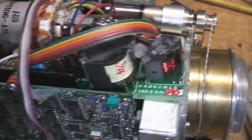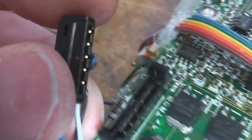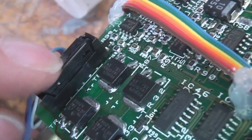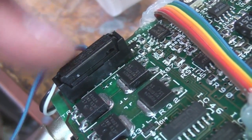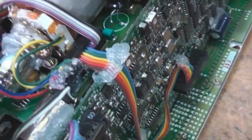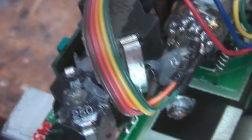Just to get the EHT voltage - I think these probably use maybe 2-3 thousand volts on the final anode on a little tube like this. And there's the circuitry at the bottom. This stuff is pretty much bog standard - this is the micro CRT video monitor, and you could replace that with a nice little LCD one. There's a slightly unusual looking connector they've used here - instead of a pin header type thing it's more of an edge connector, fairly similar to a 2mm one. But maybe when this was made the 2mm ones weren't that common. They haven't bothered using a socket for the tube - they've just got individual pin contacts going onto the tube pins.